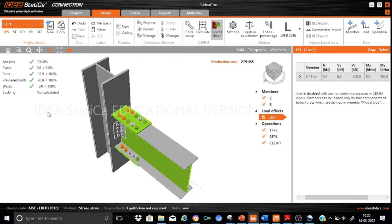And please remember that, based on my experience, normally in the field we go for two types. One is snug tight, and whenever we use slip critical bolts, what is very important at the site is that you must be able to monitor what we call the torque applied on the bolt. Nowadays we have various advanced options, even corrugated washers, to ensure that only the required pretension is applied on the bolts. And then there are various methods that people use, for example the torque wrench, and then the turn-of-nut method. Many techniques are available in the field to monitor the applied pretension in the slip critical bolts, because the performance of the slip critical bolts depends upon the pretension that is imparted to them, right? That is one thing.